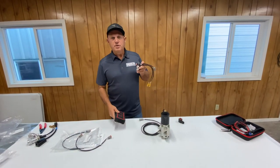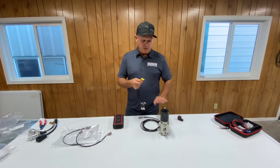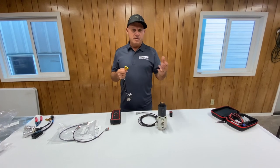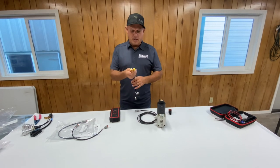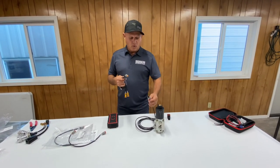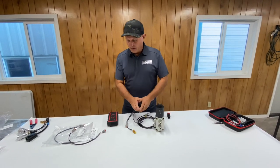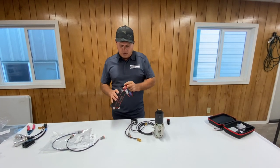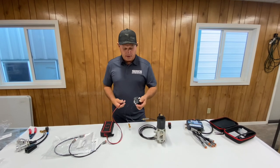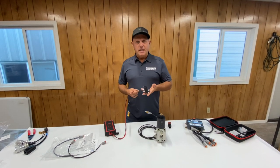For those who don't want to do any wiring, we offer a Bluetooth control system. It plugs directly into the attachment — depending on your attachment type, whether you have a Deutsch or DIN connector. Wolverine uses a DIN connector, while McLaren or Titan attachments typically have a Deutsch. If you have a Wolverine with the DIN connector, roll the harness back up inside the attachment, install the Bluetooth unit anywhere using its magnets, then plug it into the connector. The battery box plugs in as well via a harness. You can then control everything through our app — available on Google Play or the Apple App Store — controlling your attachment directly from your phone.